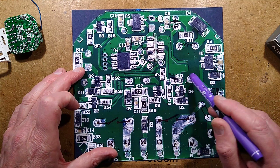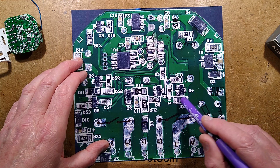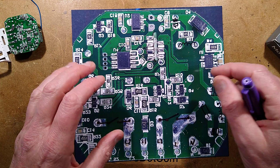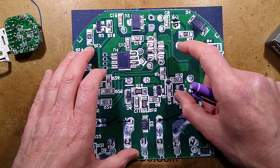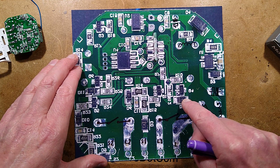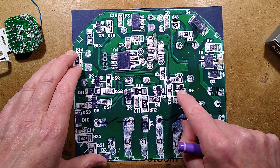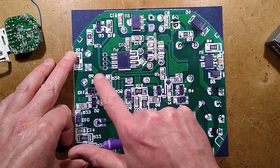Each relay, when the circuit decides to turn on, has a transistor and a back-EMF protection diode across the coil. The reason for back-EMF protection diodes is that when you turn a relay coil on and then turn it back off with the transistor, the coil de-energizes, the magnetic field collapses, and because there's no load it can create a high-voltage spike - so they put a diode across it. The transistor switches it, the diode handles the back-EMF spike, there's a resistor to limit current to the base of the NPN transistor, and also a pull-down resistor to the negative rail to keep it turned off. That's repeated for the other relay.